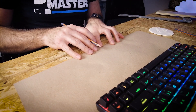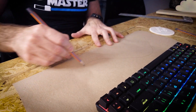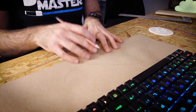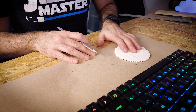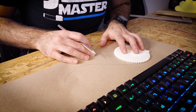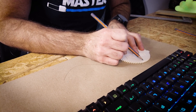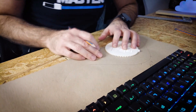Let's say you want to hand-draw the curve you want to bend — something like this and then like that. The question is: if I want to bend this shape, how can I do this? The way this template is used is by simply approximating the radius of the curves of the bends. If you place it in the right position, you'd say this is approximately a curve between this point and this point. You can count: 1, 2, 3, 4, 5, 6, 7, 8, 9, 10, 11, and 12. So this means there are 12 curves needed for a 50 millimeter radius.